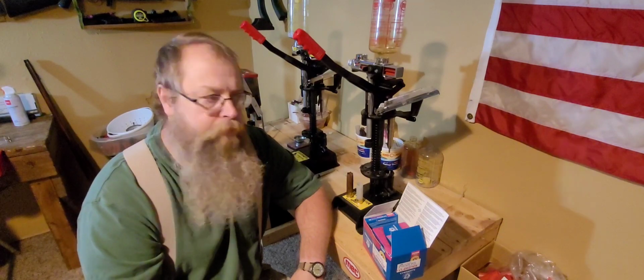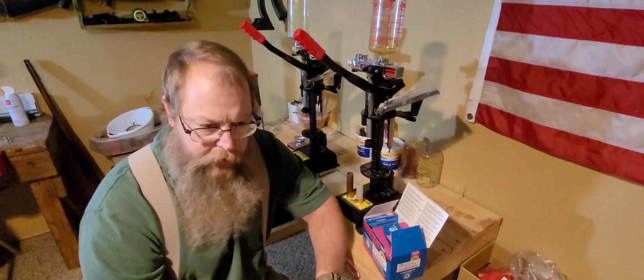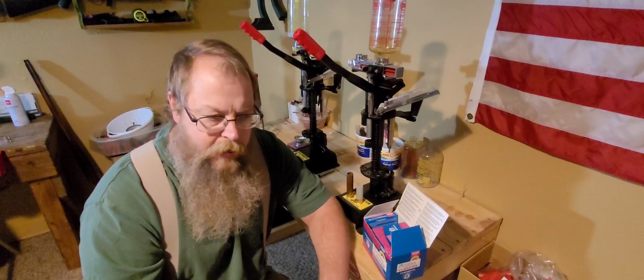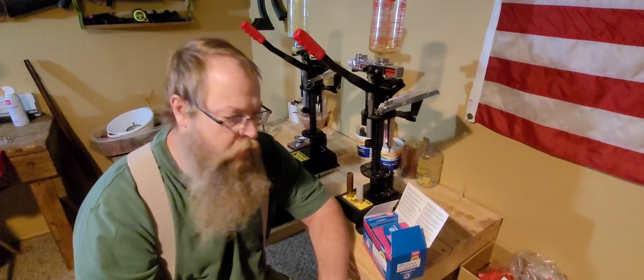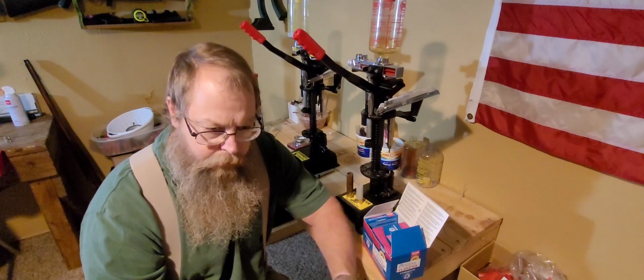I blew up a Russian handgun one time because I must have double tapped the powder, and you don't even notice. But I bought the RCBS check die that makes sure it's going to be in the ballpark, and that seemed to work a lot better. And the thing about that progressive press is that you got to keep pumping it all the way down. You can't do the half pump because that's going to double tap that powder drop. And then it'll stop because it hit the RCBS check die.